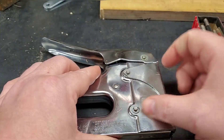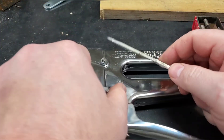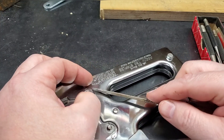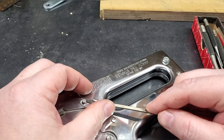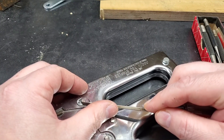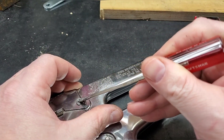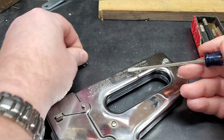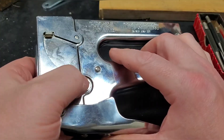To take them off, be careful because you can damage them — they're just really thin metal. Also be careful because you could poke a hole in your finger if you're not careful. Just push on the sides and get to where you can push on the back of the e-clip. That comes off — then push the pins through.